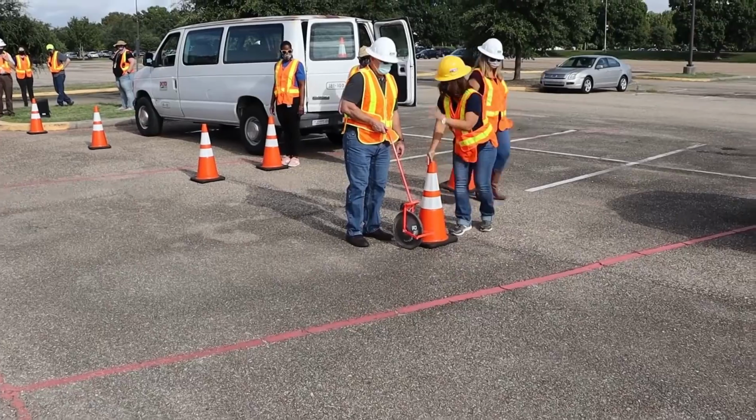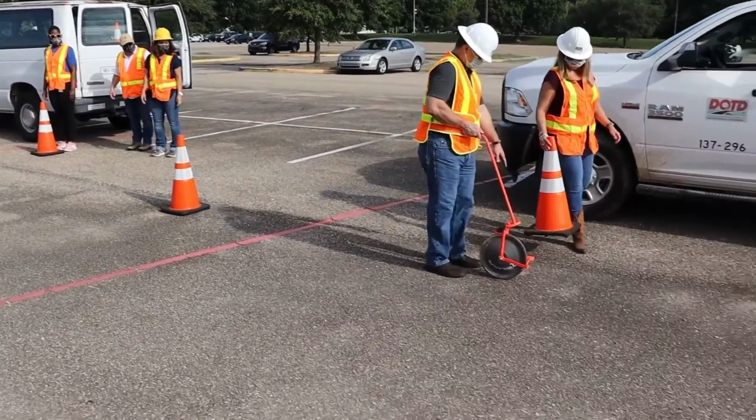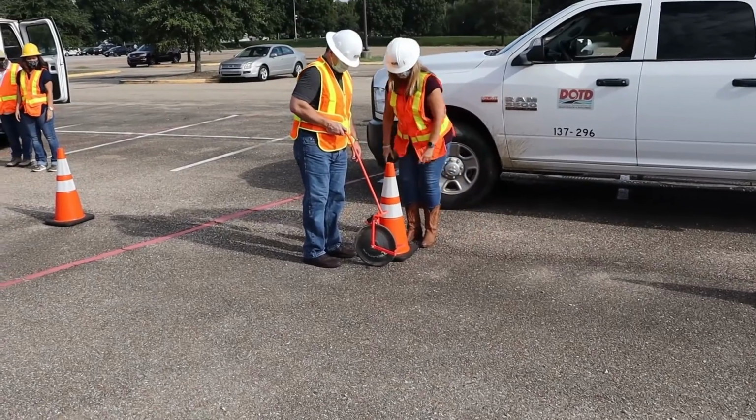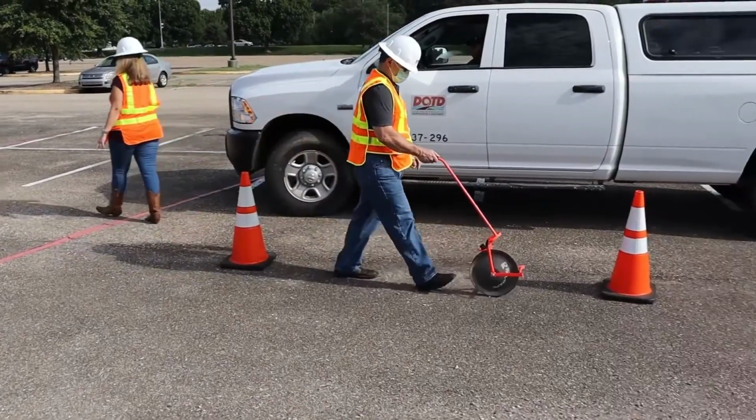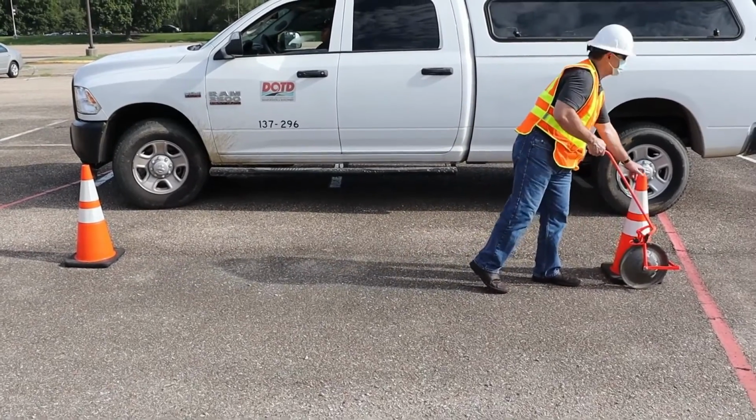You can go ahead and line up the cones along the shoulder of the road now if you like, but be careful that any work along the shoulder must be marked with a vehicle with a flashing light at a minimum. And always walk along the shoulder facing traffic.